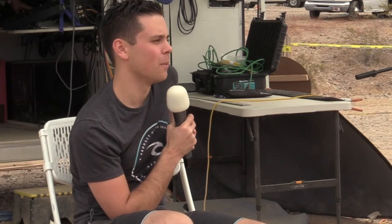If power is available and you have a lithium battery, it just absorbs it — any power that's available, it will push in the instant there's sunlight. If you have a flooded lead-acid battery at 50%, the efficiency is actually higher and it charges pretty quickly in bulk charge. But as it increases, it slows because the internal resistance is increasing.